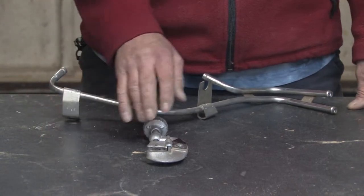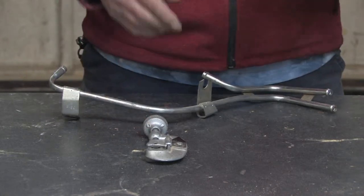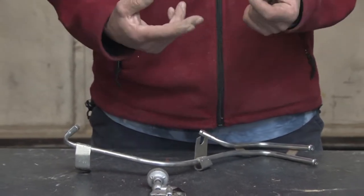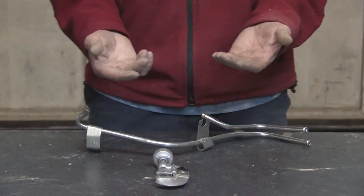The best way to perform this task is by using a steel tubing cutter. What it does is it uses a cutting wheel, and by you manually rotating around the steel tubing, it will thus cut the tube. And it does so relatively effortlessly, and it does a real clean job.